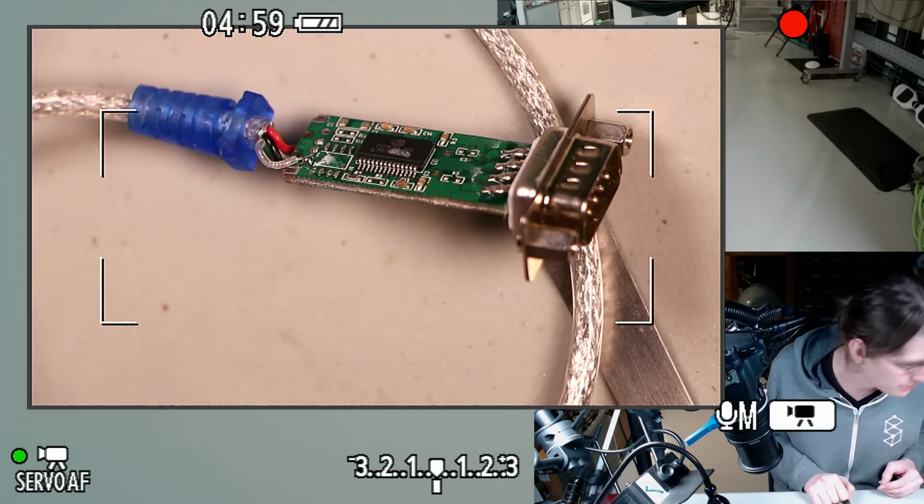I know I could have a microcontroller and the modified serial thing. I mean, I'll think about it. That would be one option, to have a little backpack board that sticks on to this thing and has another microcontroller, or possibly even just, you could do this with an analog circuit, like a little RC timer, but it's almost easier to do it with a microcontroller nowadays. And it's certainly electrically simpler. But yeah.